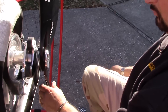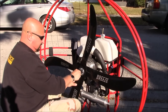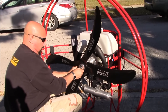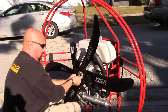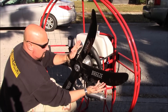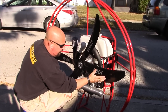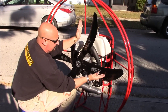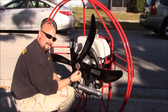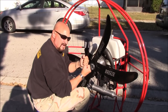We're going to take another bolt and stick it in the 6 o'clock position on the prop hub, wiggling it a little to get the thread started. Once we get two bolts in, the others line up much easier - hand tighten only for now. You'll notice the Fresh Breeze props are not perpendicular to each other - they're slightly offset. The Germans figured out that if the blades were directly opposite, each prop would cut through slightly disturbed air, reducing efficiency. Offset blades cut into clean, undisturbed air for more thrust.